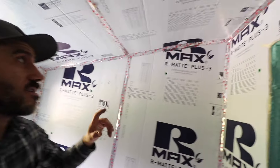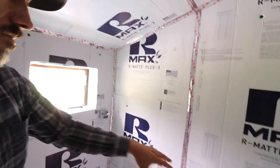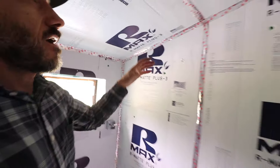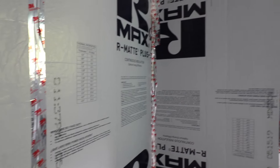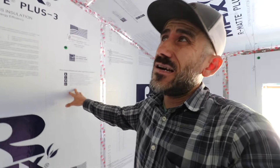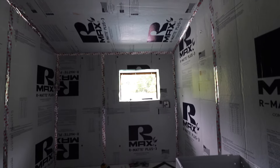The insulation is done — four and a half inches of insulation. You can actually leave the cold room walls like this, but you'd have to be pretty mindful not to hit them with corners or boxes. Over time it would probably show some wear and tear, so in this walk-in cooler we're putting in three-quarter inch plywood.